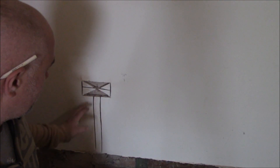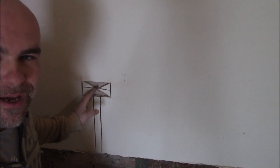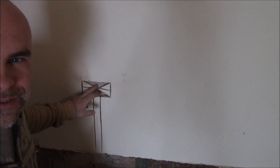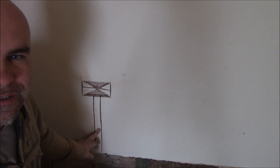So this was the easiest part, but the more dusty part. Now I'm going to use a hammer and a chisel and chisel it out — all the plaster and part of the bricks, and also from the channel, just to fit the 35mm back box.